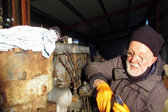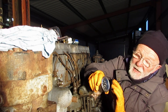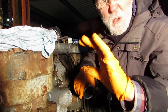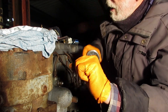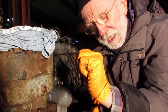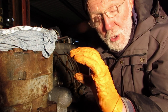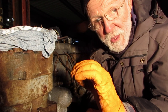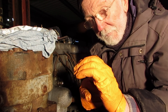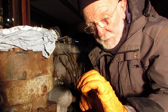It's not complicated — dead simple. Now how does the gauge itself work? Very, very simple. I don't have one to show you but I'm going to try and illustrate it using my hand. If you can imagine my fist like this where my fingers are a coiled pipe — the oil pressure comes in the bottom here and as the pressure comes up the pipe straightens out. On there there's a little chain wrapped around a little gear and that's what causes the pointer to move. It's pathetically simple.